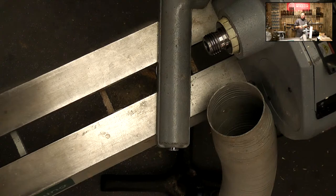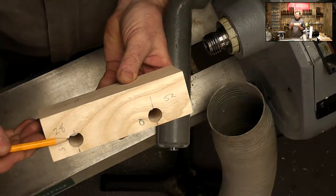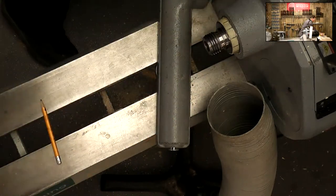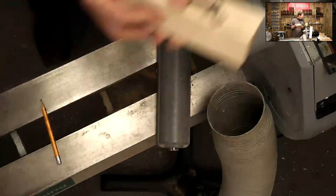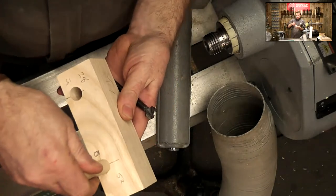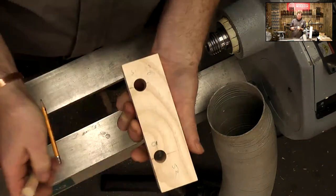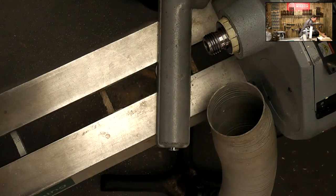We have our block here with two 16mm diameter holes drilled using short pattern Forstner bits — less wobble. The reason we've gone 16mm is so I can use 16mm dowel pushed straight in: nice, accurate, and secure. The axle for the back is 52mm from the back, 28mm on the front one. We'll try and get that drawing put on so you can have a look.